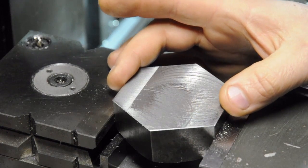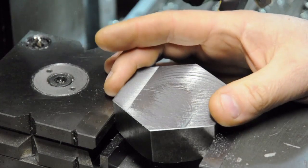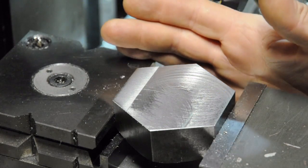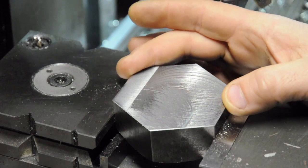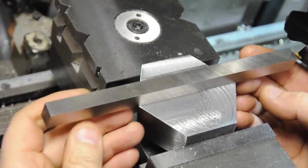If you could do this in one pass with a large enough face mill to cover the entire workpiece you'd at least get a consistent surface finish all the way across. That's one of the big advantages of a fly cutter - you can adjust it to be larger than your work to potentially do things in one finish pass. They don't move as much material as a face mill but the surface finish can be much more consistent.